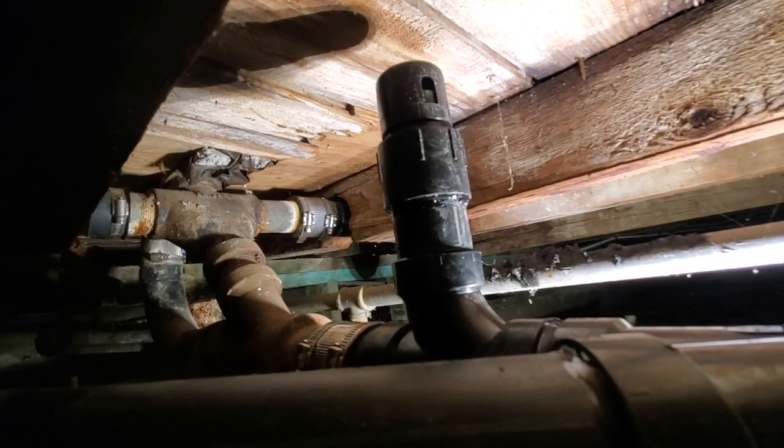Here's what's going on with the AAV. This is a quintessential example of service plumbing dealing with people who don't want to pay a lot and don't care if things are done up to code — and no, this is not going to be inspected. Number one, the location of the AAV: I'm fully aware that where I put the AAV is essentially wet venting the shower I just redid. I could have put the AAV on the trap arm right after the trap, but I put it where I did because I wanted to make sure the shower next door, still fixed to the back-to-back double fixture fitting, is getting enough air as well.